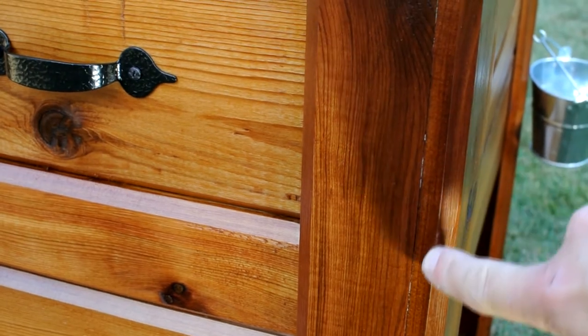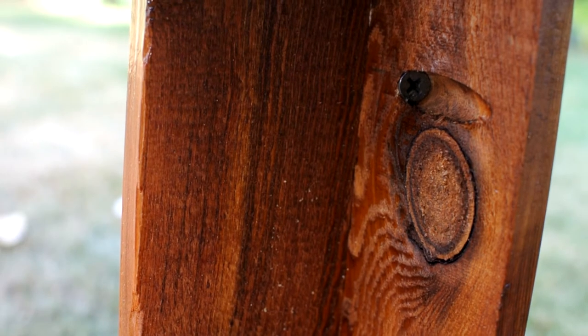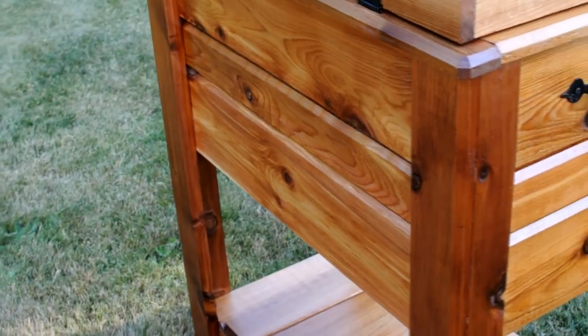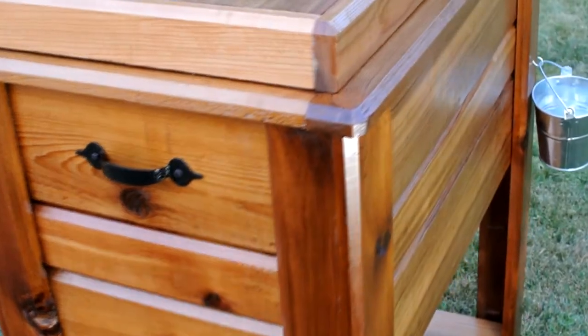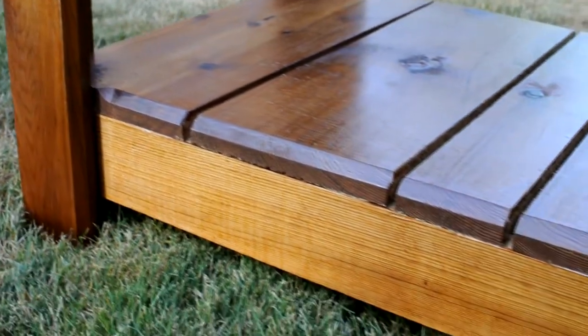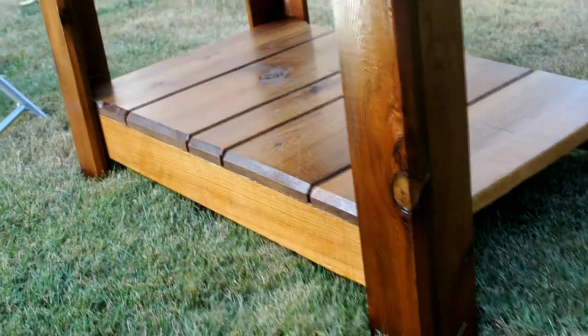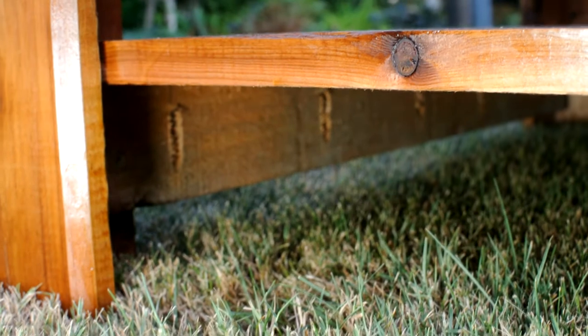This gives a nice appearance from the front of the cooler and hides the end grain. I fastened these together using subfloor adhesive and pocket hole screws — I'll link the Kreg jig tool I used in the description. Now that we have the panels and legs built, we can assemble the top portion, again using subfloor adhesive and 1-inch wood screws screwing in from the back. Building the shelf was pretty easy — I took the inside width between the legs, used that measurement to cut the runners, and ripped down some boards giving a similar style as the panels, again with subfloor adhesive and pocket hole screws.